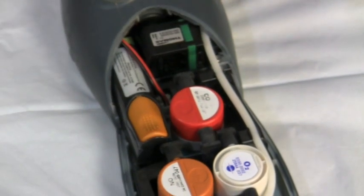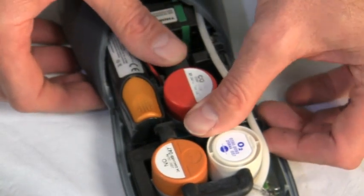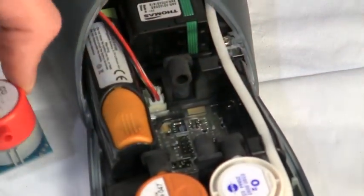All these sensors are socketed. Let's look at the carbon monoxide sensor — that's this red sensor here. I can actually take the internal plumbing off the sensor and remove the sensor from the sensor holder. Sensors don't last forever. The warranty on the oxygen sensor and the CO sensor on this 330-2 is a four-year warranty. Simply take the new sensor, line up the pins, and it will fall right in place. Then connect the internal plumbing so that you have the flow of flue gases going through the sensors.